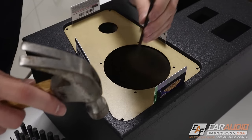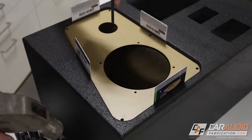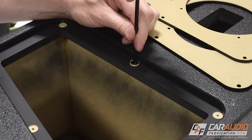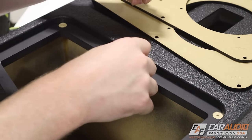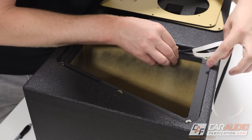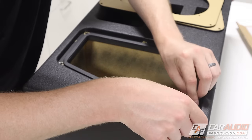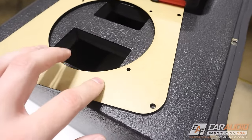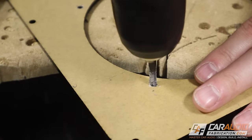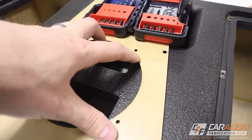But if you're just going to use this for a shop stereo and keep the same speakers, you could just use a jigsaw on a piece of wood, cut out the hole, and mount them using wood screws. I'll position these plates and transfer those mounting hole locations. Much like I did on the back to mount the head unit, I'm going to use threaded inserts so I can take these on and off multiple times without the degraded quality a wood screw would give. Once those threaded inserts are added, I also added acoustic foam to give me a nice seal between the speaker baffle and the cabinet so we don't have any air leaks. Now before I can get the baffles mounted, I do need to tap these holes — basically adding threads to the acrylic holes so I can use machine fasteners to hold the speaker in.